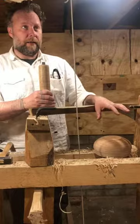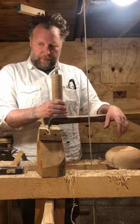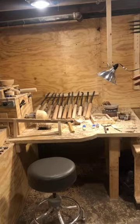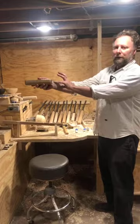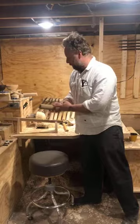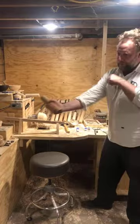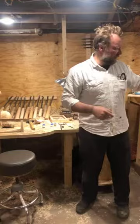Next week on Sunday I'll do some pole lathe turning at three, same time. So we move to my Japanese-style lathe. These are descendants of that strap lathe in a more direct way. The technique involves a shaft with spikes on it — imagine a giant mandrel spinning back and forth — and you'd hammer your bowl blank onto it, but there wouldn't be a tailstock at all. Just your workpiece suspended on two bearings, wooden bearings at the earlier times. It's going back and forth, and because of the assistant driving the strap, you have power on both directions. Unlike the pole lathe, the return spring doesn't have enough power to make a real strong cut.